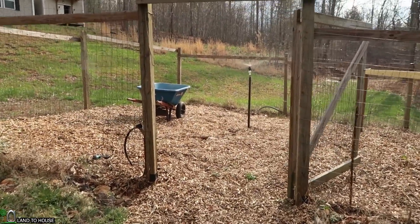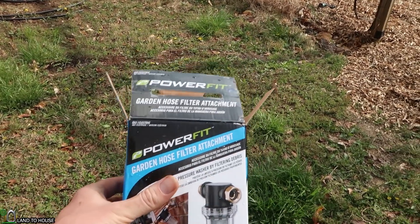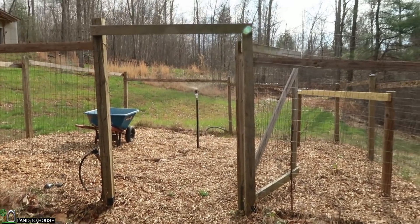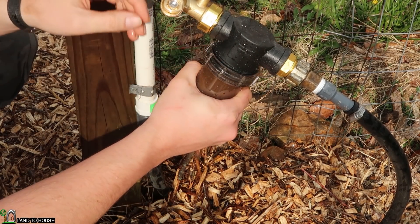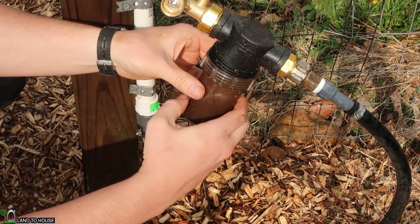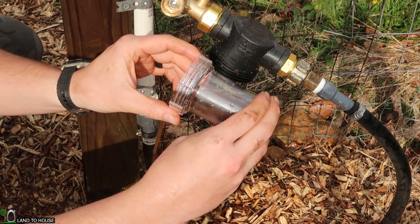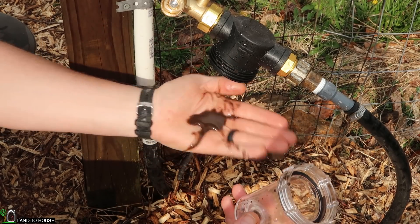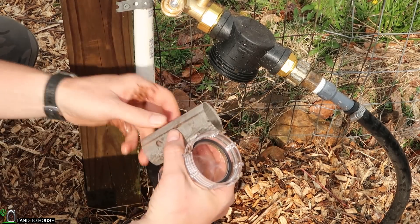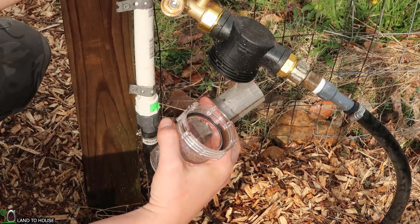The hole in the wobbler is pretty small and can get stopped up pretty easily, so let's crank this up and see if we can catch some debris. This was a PowerFit from Amazon — I'll have a link to this in the description below. Where we had just been disturbing the ram pump, this water is now pretty nasty looking. The screen is still fine there. Mostly just some silt that I'm seeing — nothing too big in this round. But it doesn't take a whole lot to stop up a drip irrigation system, as you may know, so this kind of thing is very important to keep that system safe.